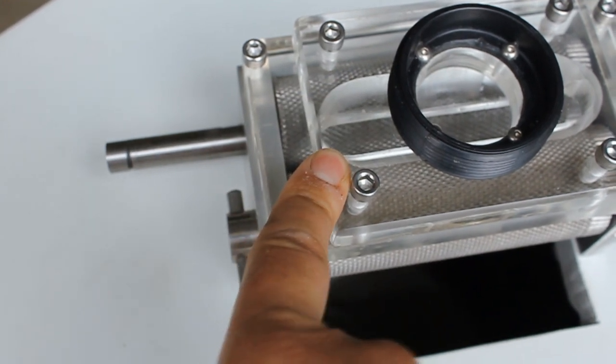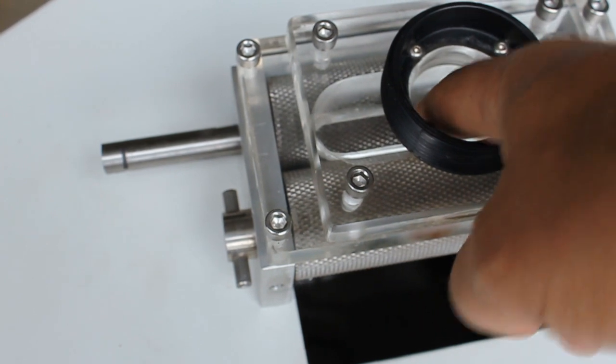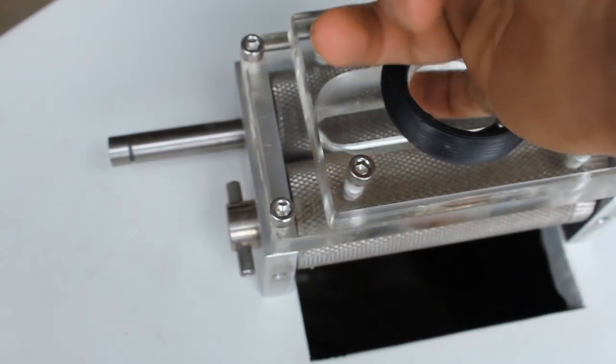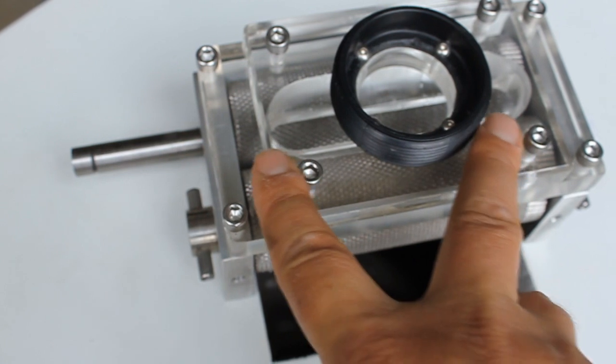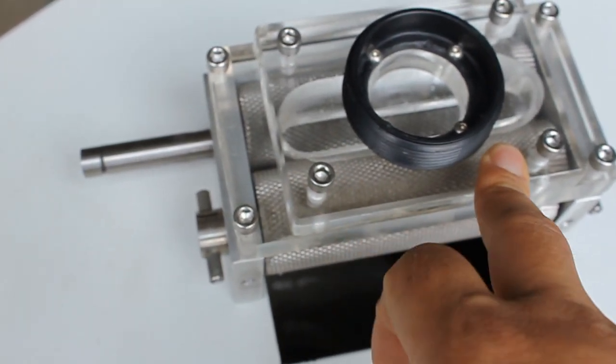This bottom piece has a 1/2 inch wide by 4 inch long slot, and then I also put a curve profile on there. It's like a cove bit on the router. So when grain falls down through this hole, you could see, let's see, right there. So grain falls down through here, and it'll spread out at least 4 inches wide, and then fall down into the middle of the rollers.